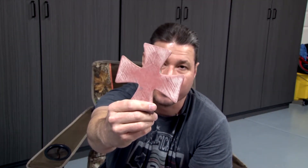The other thing about this pattern that I thought I'd try that I haven't tried before is on the back of it I have Bondo and it just makes it smoother so the sand doesn't stick inside the pattern. The other thing that happened was as it was 3D printing I had a little side not fill out correctly from the 3D printer — it warped from heat and cooling. But anyway the Bondo allowed me to fill it in and save an eight-hour print. I think I'm probably going to incorporate Bondo a little bit more into my 3D projects to fix some things that the 3D printer didn't make perfect or to smooth things out.